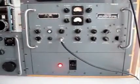It's compartmentalized as the CV157. This is a rather large machine that basically facilitated the reception of single sideband and various data modes. It comes with a mechanical AFC facility. On the left you can see a couple of meters which read out audio levels and carrier levels. There are a number of knobs and buttons — for anybody into knobs and button pushing, this is the one to have. It does have 44 tubes and the whole lot weighs something like 35 kilos, so it's not for the faint hearted. But it does provide an extremely good, clear single sideband audio out.